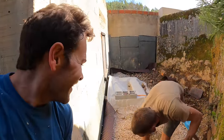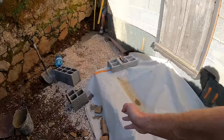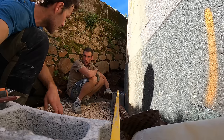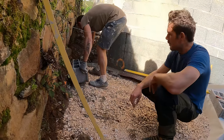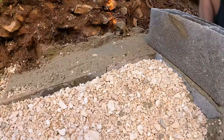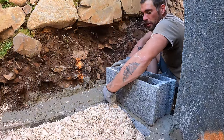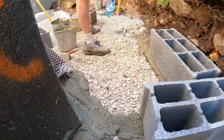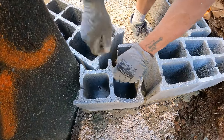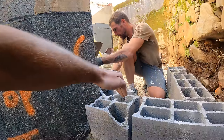Starting to look like a patio back here. We put that covering on while I was gone for all the rain that was happening — good thing, because it just drained this way and we got to see that our French drain was working properly. This will be finished concrete height plus tiles, whatever paving. We're continuing a little bit of a slope. The drainage system in the back gives us the next row of blocks going in — we've got a nice little base layer, built the trough out of mud, and it's going to suck these blocks down. This will be the level of the area, and then these will be the steps down.